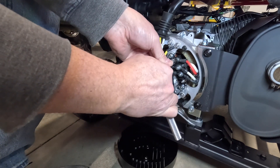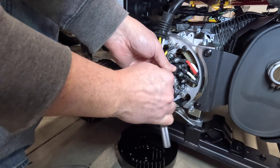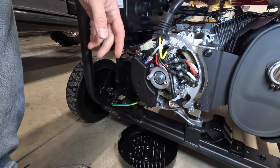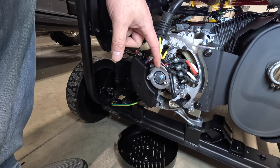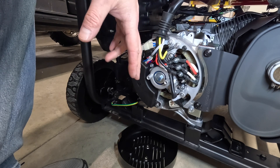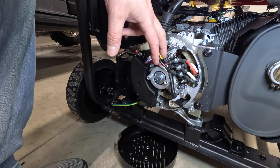I'm just going to check the tightness of the other ones while I'm here — they're all pretty tight, so should be good. That basically unbonds it. We'll do another continuity test here to prove that it's been unbonded at this point.